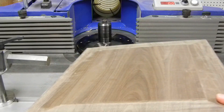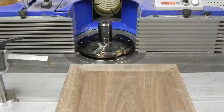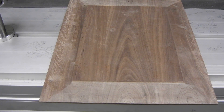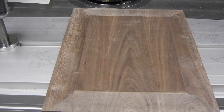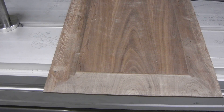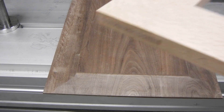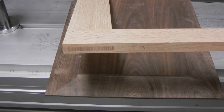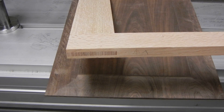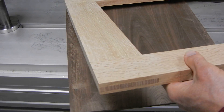These raised panels of the two doors here are approximately four-tenths of an inch total thickness. They might look a little taller in this lighting, but they're relatively thin. I've ended up with about four and a half millimeters where the edge of the profile is seated into the groove of a rail and stile door. I'm going to be running a bridle joint in the corner for both the red oak and the previous walnut. This one is loose, so it's flopping around a bit.